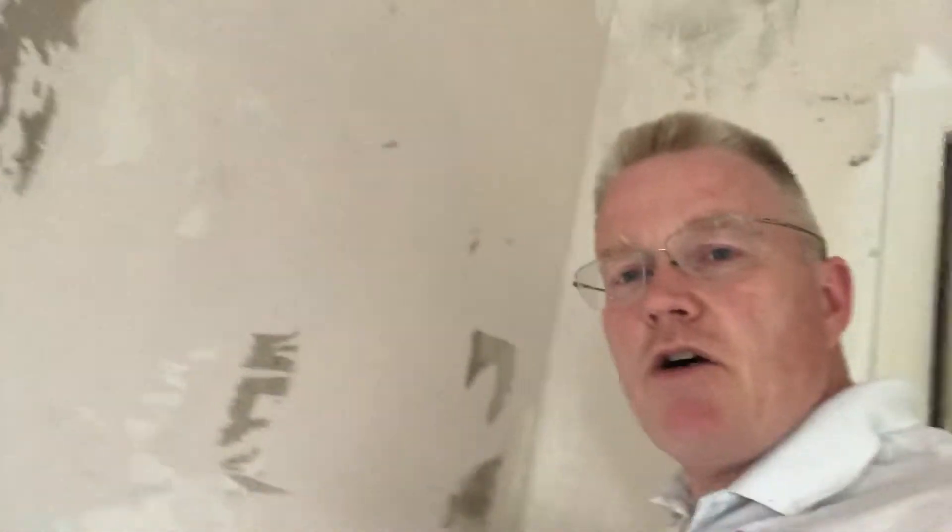When you're removing wallpaper, you remove it in steps of difficulty — you try the least intrusive measure first. Just wetting the edges didn't work, so I decided I would penetrate the sheets of wallpaper horizontally and vertically, cross-cutting in a checker-like fashion so that I could wet and saturate the glue underneath to lift it.